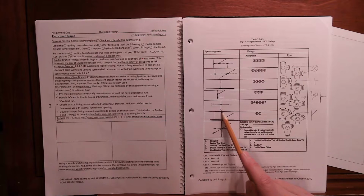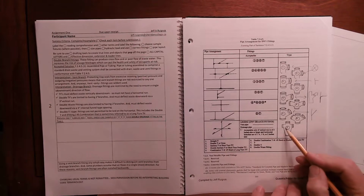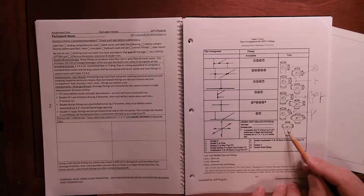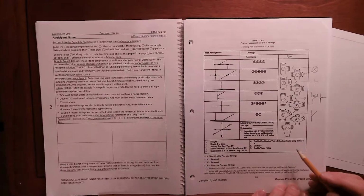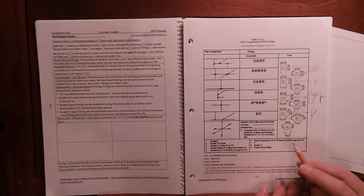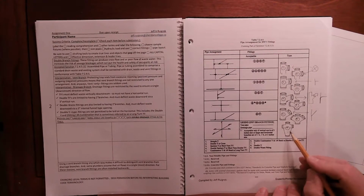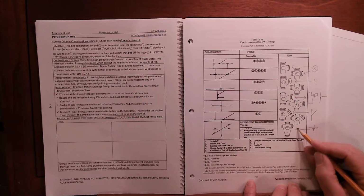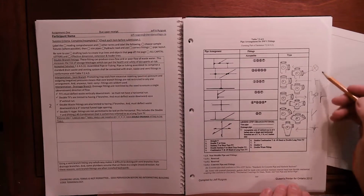So it's number 9. If you put number 9 here, you have to have a vertical drop of 3 inches, but that 3 inches lies between here. This is one of the only funnel fittings available for us to use in the plumbing code. Anyway, so watch for that. The symbol for this one is often like this. And you know the symbols for the others.